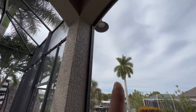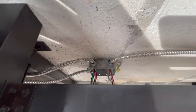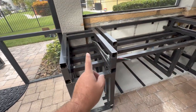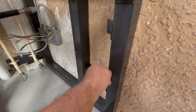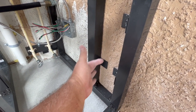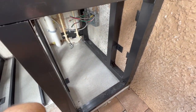That light right there as well as the perimeter lights all the way around the pool cage — that switch will be right there. This box here is where those wires come together and go up the wall for the lights. This little box will be for the refrigerator and the side burner. And I'm going to put one more outlet right here that will be easily accessible through this door.